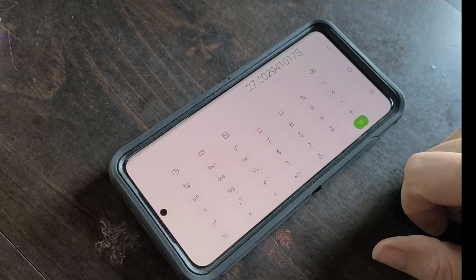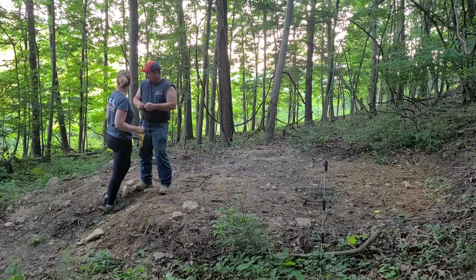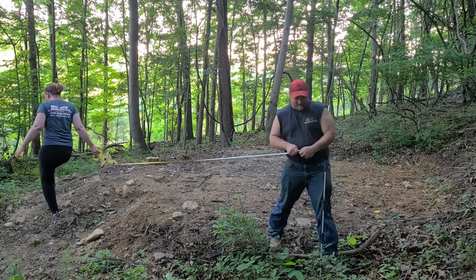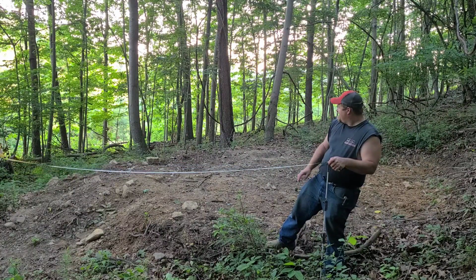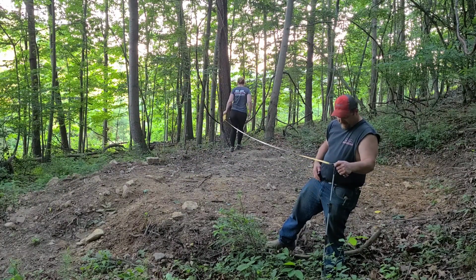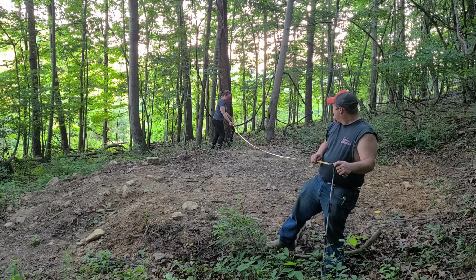27.2. That is the distance in feet that should measure between the opposite corners of my building to let me know if the stakes my dad and I put in the ground are square. Now, I think my dad and I have a pretty good eye for things, and I was willing to wager a trip to the local ice cream shop with my husband, saying that I was within 6 inches of square. My husband has been helping people with small building projects for quite some time as an excavator, and he assured me that nobody's eye is that good, and I would be at least 8 inches off.